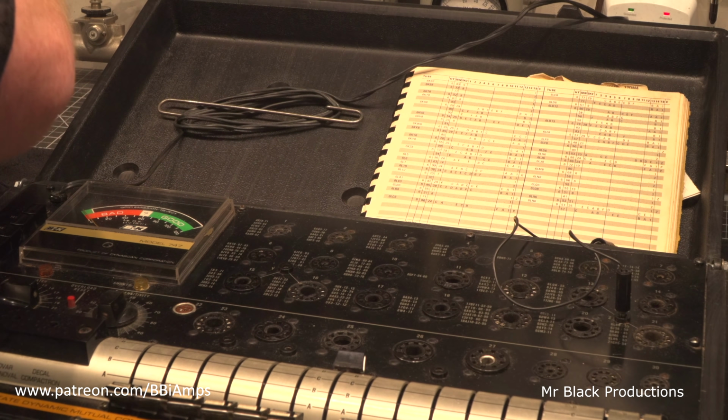But Zane got this for me on a steal. Back to the original topic. He got this for me on a pretty good steal at a Hamfest. The hinge was busted off on it, and the latches don't work no more. I had to go through and completely recap it and touch up some solder joints and stuff. But B&K, all their stuff's out there on the internet, and I downloaded the alignment manual and made sure everything tested within spec, and it did.